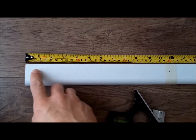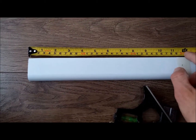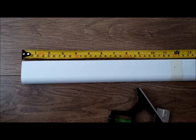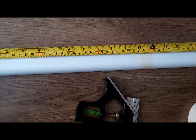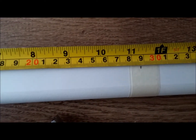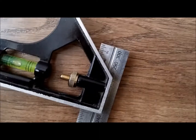Ensure you've got the right end — this is the end that is going to butt up against the wall. At approximately the distance you need, wrap masking tape all the way round the architrave. This will protect the architrave when you cut it. Then measure and mark with a sharp pencil your precise measurement. I was looking for 289 — looks like I've actually got 288 there.